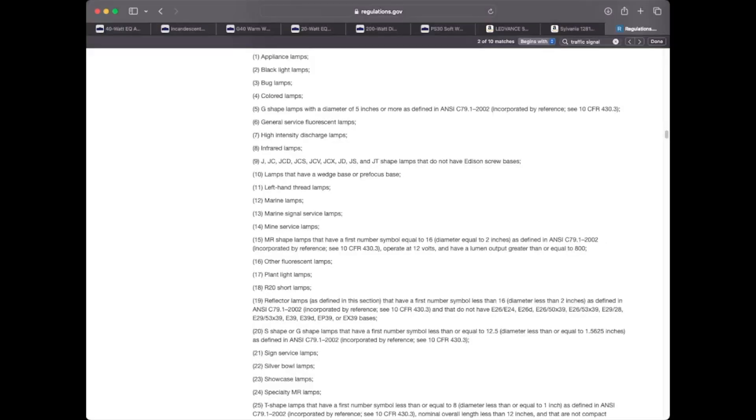Let's talk about light bulbs. As most of you know in the United States this year they banned the majority of incandescent bulbs. However there are still quite a few you can get, including appliance bulbs, traffic signal bulbs, bug lamps, heat lamps, and some other things. As far as choosing a bulb for your dim bulb tester, it really depends on the load you are connecting to it. If you are doing something like an old All-American 5 radio you might want a 25 or 40 watt bulb. If you are working on a vintage hi-fi receiver like a 1970s Marantz or Pioneer, you can probably start with a 60 or 100 watt bulb. I usually leave a 100 watt bulb in my tester most of the time.